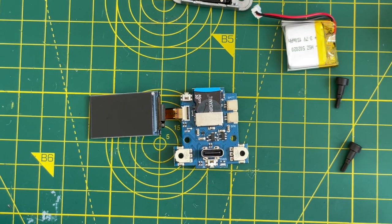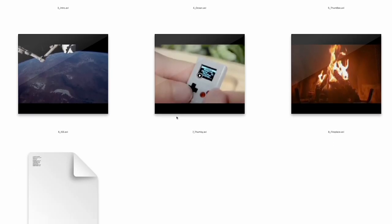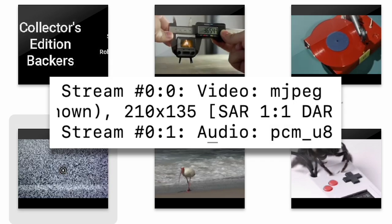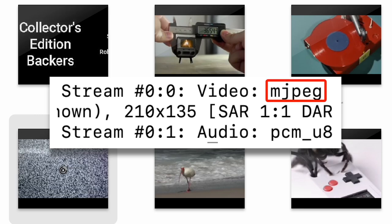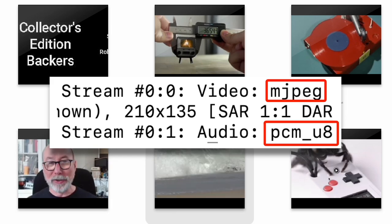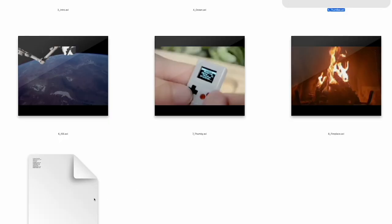We'll take some photos of this and see what it's made up of. Let's start off with the simple bits. We've got our cute little battery of 150mAh with a nice battery protection PCB built in. And we've got a very generous 8GB SD card for storing videos. If we look at the contents on our computer, we can see a bunch of AVI files. The video files all play without any problem — they are standard movie files. We can use one of the FFmpeg suite of tools to look at the format. It's pretty simple: it's a motion JPEG, which means it's just a sequence of JPEG images, and the audio is just 8-bit PCM. This is quite a common approach to playing videos on microcontrollers, as decoding a JPEG is considerably simpler than decoding a full video stream.